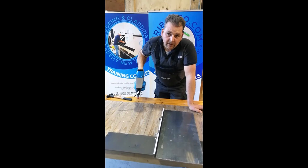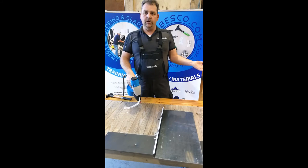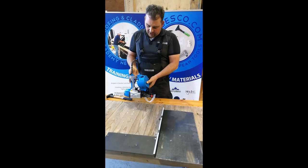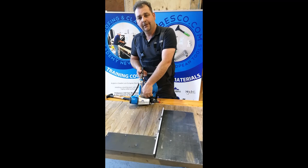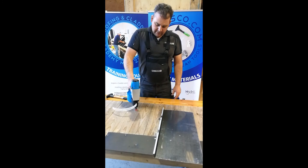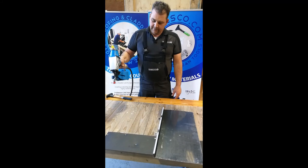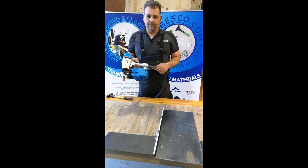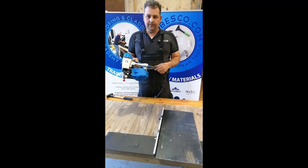You can shoot way faster than with the other guns, so it depends what you're doing. On the back there's a lever you have to physically change — otherwise it's not legal to sell. So that one here is now single action: you have to press and fix it, press the button once, it can't fire otherwise. That's all set up in the handle. Different nail gun, 15 degrees, different nails.